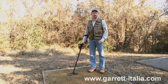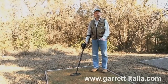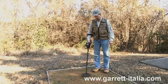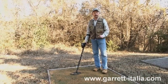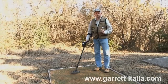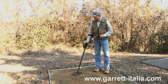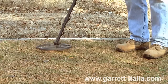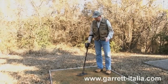To demonstrate the value of proper ground balance, we're out here in the Garrett test lanes. I've got my AT Pro ground balanced for neutral soil — listen as I go over this highly mineralized pit of dirt. It's clearly picking up the mineralized ground. Now down here we've got a nickel coin buried a year ago at an eight-inch depth. As I go across it, I'm not consistently picking up a good target signal — I'm just getting ground response because I'm improperly ground balanced. So I'm going to step off to the side and use my automatic ground balance, pumping the coil up and down above the ground until I get it into proper ground balance. Now I'm not getting that ground reaction — I've got a good, clean, huntable situation.